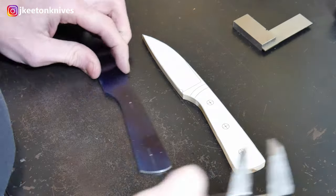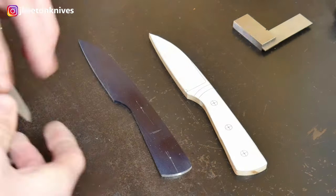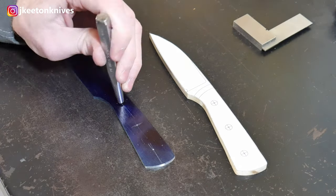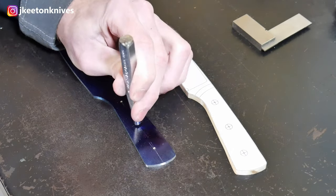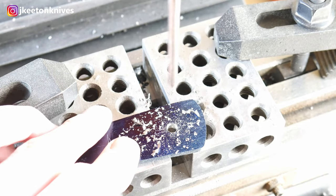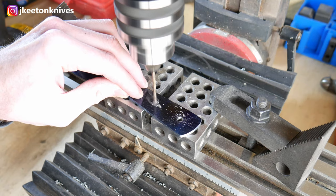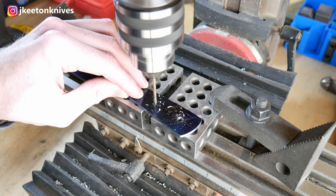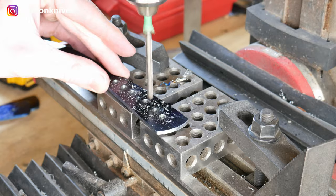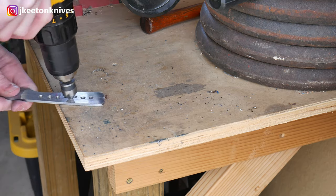Next, I got this thing sprayed with some layout fluid, and then we start laying out our holes for drilling. We're going to be drilling two number 13 holes for our Corby fasteners, and then also a center hole for an eighth-of-an-inch decorative pin. After we have the center punched, we'll head over to the mini mill to start drilling. I'll also be drilling some weight reduction holes in this tang — not only to reduce the weight, but also to allow a pathway for the epoxy during the glue-up. Those holes I'm drilling with a number 12 bit; I have maybe 15 of these bits and use them as kind of my trash bits.